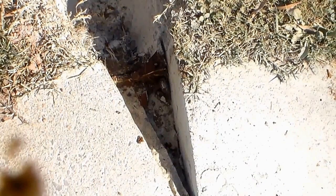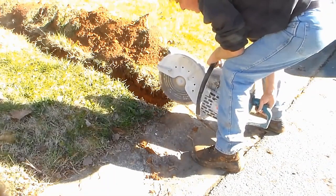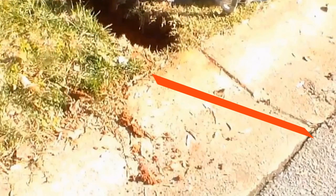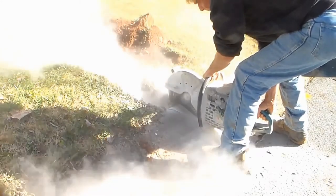Let's take a look at how to cut a V in a half round curb. This is a little bit tricky. A lot of people are really afraid of this, but I'll tell you what — this is easy to do, I promise. In this example, we're bringing downspouts and catch basins out to the street. We are collecting a great deal of water, and we need this to go out into the street gutter. You'll notice that I'm using the expansion joint of the curb. Very important — if you can bring your line out to that expansion, it'll make it a lot easier. We're going to make three cuts. The first cut defines how wide the V cut will be in the curb. The second cut allows us to remove a section of concrete with a pry bar. And the third cut is right down through the expansion. This is a little dusty, but take a look and you'll see what I'm talking about.